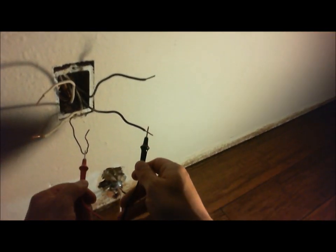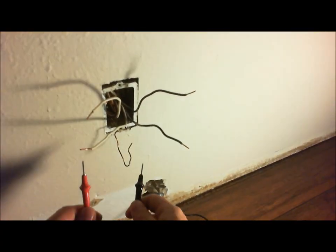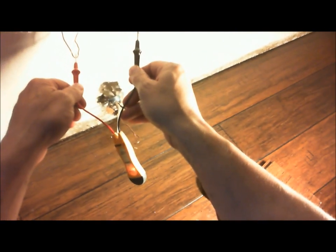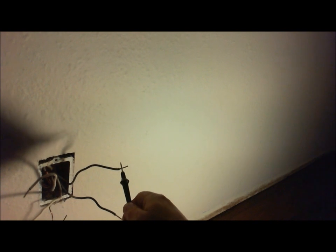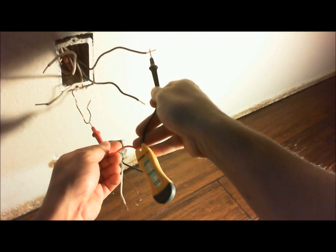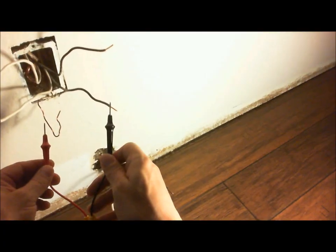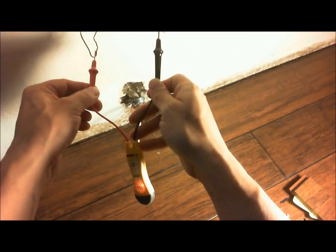To test this outlet we go from the black wire to ground, and you can see 110 lights up — 110. And the corresponding neutral to ground, there's no power on that because it's the neutral line. So this one from the breaker to the outlet just has 110. And then for the line that leaves the outlet and goes to feed the rest of the room, there should be no power on that because it's not going through the outlet — it's not connected to anything right now. We can test that and you see nothing, and the corresponding neutral to that one also has no power.